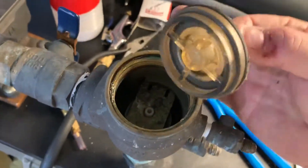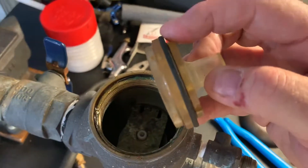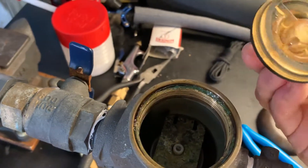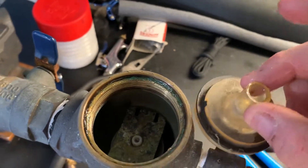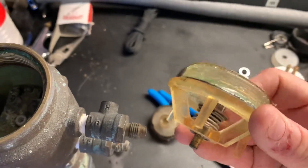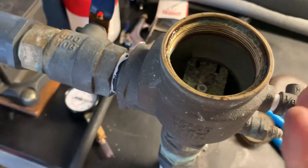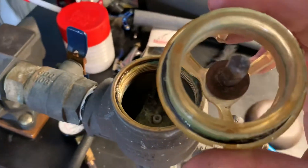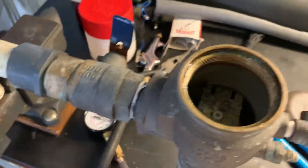You can take off the little clapper here, which has a rubber seal on it. That rubber seal on this piece is just free-floating — it comes up and down and actually hits against this metal plate here for the spring. When the pressure inside this housing is up to your standard residential 50-60 PSI, it will force this to raise up, hit this spring, and seal water from coming out of the housing through the hole you see here.